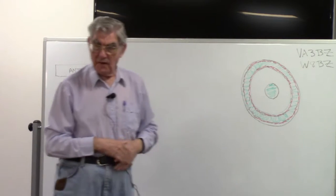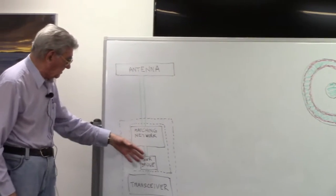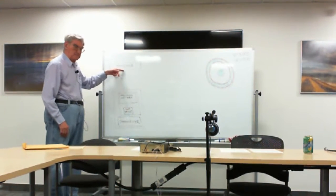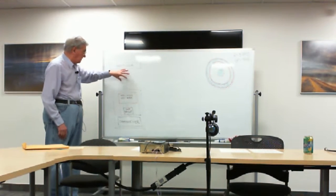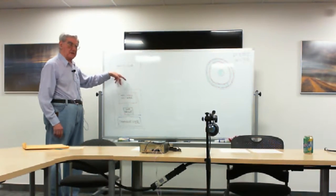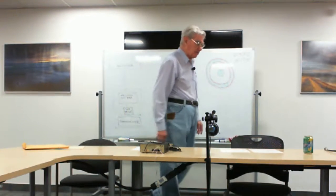And a way to achieve that is by doing something like this, but remember that if this is coaxial cable that's being used up here, you really do not have a properly matched condition here, and there is a possibility you might get quite a lot of radiation from the coaxial cable. The ladder line, what happened to my ladder line? Oh, here it is.